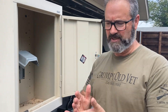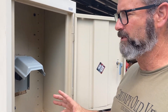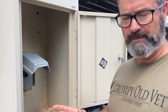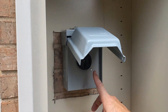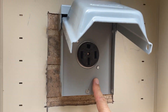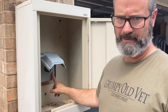Here's a great example. If you know your specs, you've worked out your supply — checks and money — then you look at location. Any 220, current code cycle, that is in the garage or anywhere outdoors is going to have to be GFCI protected. So when I installed this probably two years ago, it was not. You'll notice it's a 14-50 — it's a four-wire. I've charged a couple of different cars out of here, actually just the Mustang. But this is by far the most common outlet — virtually every EV charger in this case will run off of this.